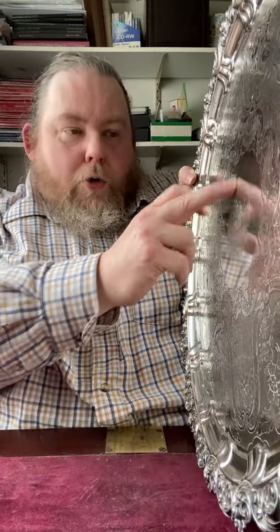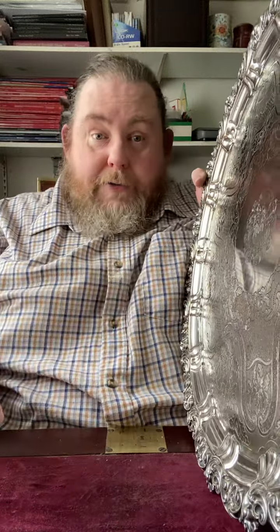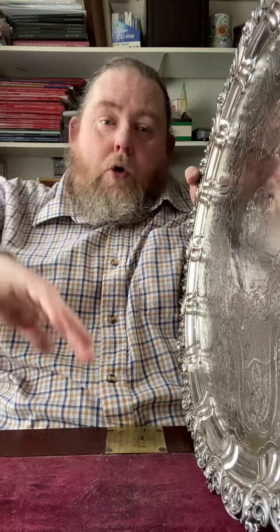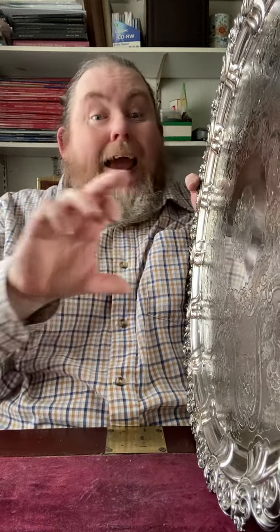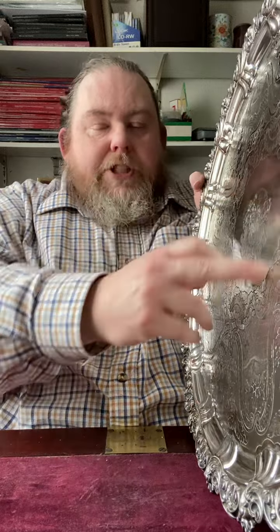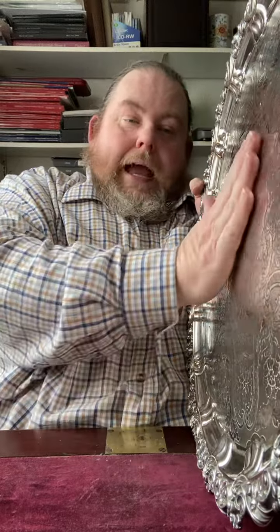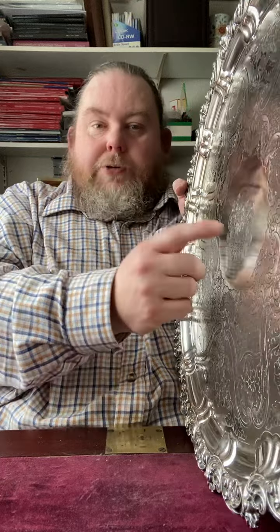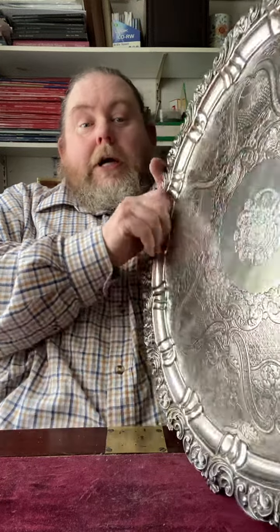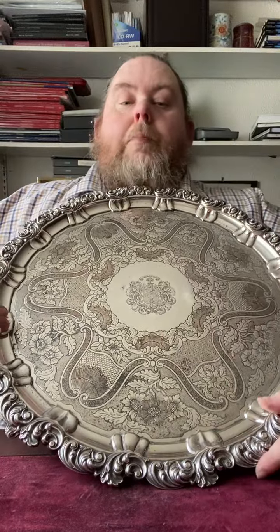It's a small disc in this case, often on tureens, vegetable tureens, or meat domes in Sheffield plate. It won't be a circle, it will be a rectangle, but you get this reserve of pure silver that is fused on to the piece. It's added on and then hammered flush and rolled flush, and it just gives you that thickness to engrave that coat of arms, as you can clearly see, quite successfully without going through to the copper below.